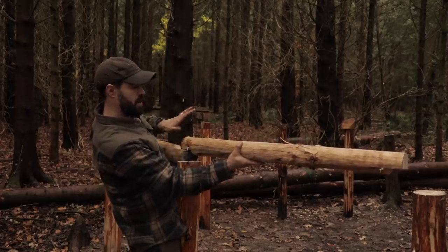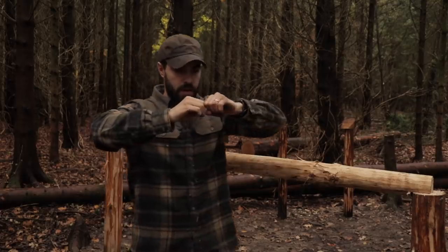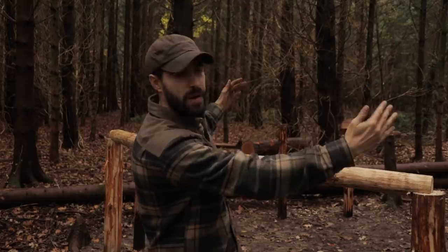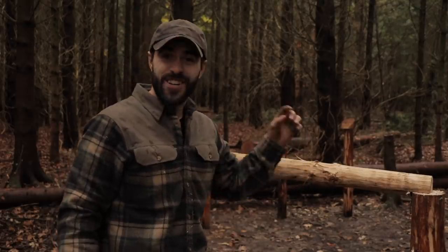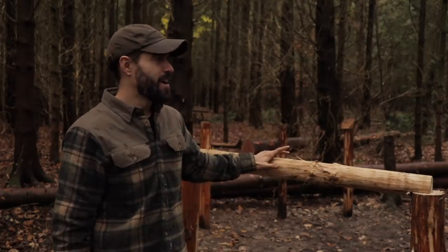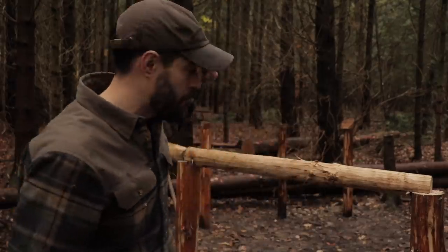lean down on them, that means that the rafters are going to be all wavy, and the kind of battening that goes around the rafters is going to be wavy, which means all the thatch that goes around the house when we thatch it is just going to be like that. And luckily, what was it, about 10 minutes into doing this, Dustin? Yeah, about that. Literally 10 minutes into doing it, we literally stopped and went, something's not right here. And then thank God we did, because we've only made the mistake on the first two posts and beams. If we had done it on like the 14th one, we'd have been crying.